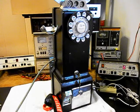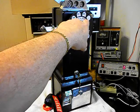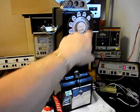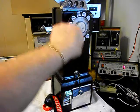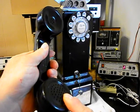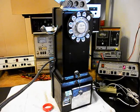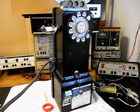I have a button on my amplifier and I can give dial tone or take it away at any time. Now we can use the rotary — if you watch the analyzer, you'll watch your numbers roll by. Now we can transmit into the handset. If you watch that red light on the analyzer, every time you see that red light light up, that's an indication of 100% modulation on transmit.